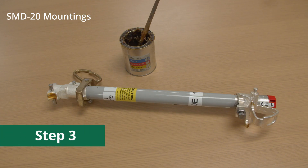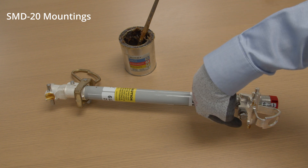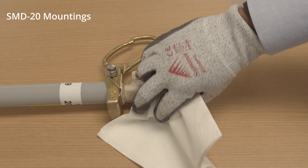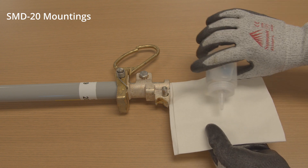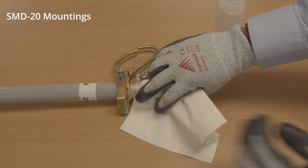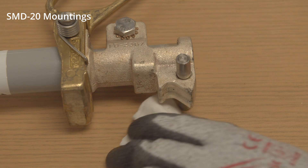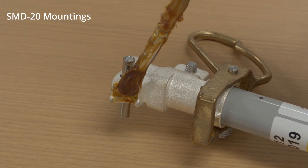A coating of No Oxide A Special contact lubricant has been factory applied to the current-carrying surface. Verify the presence of this oxidation-inhibiting grease and that it is still free of contaminants. If necessary, clean the surface with a non-toxic, non-flammable solvent and apply a coating of No Oxide A Special contact lubricant or similar non-metallic filler oxidation-inhibiting grease. For reused fuse unit end fittings, remove the existing coating and dirt from the current-carrying surfaces using a non-toxic, non-flammable solvent. Inspect for evidence of pitting. If pitting has occurred, file down any projections, abrade the surface until smooth, and wipe clean. Apply a new coating of No Oxide A Special contact lubricant to the current-carrying surfaces.